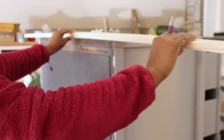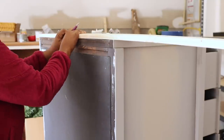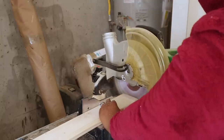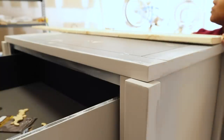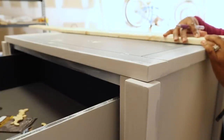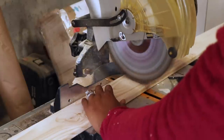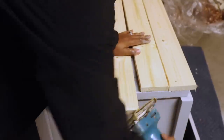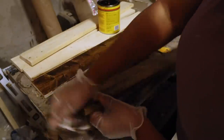The next step is planking, which is my favorite thing to do. I'm going to plank the top of this chest drawer and also the end table. I'm measuring out where to cut on my miter saw — the board size is about a one by four. I'll get my cuts done and then lay them on top to make sure they're even and not warped, because sometimes wood warps on you. Then I'll take my electric sander and round out the sides and smooth the tops of each piece. After that I'm going to stain them using dark walnut.